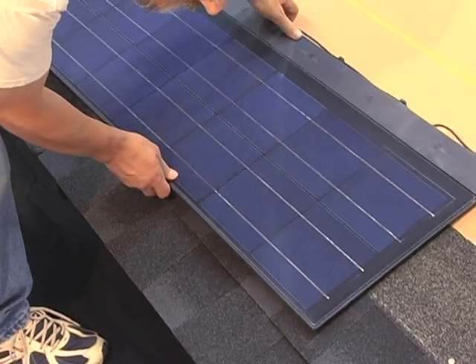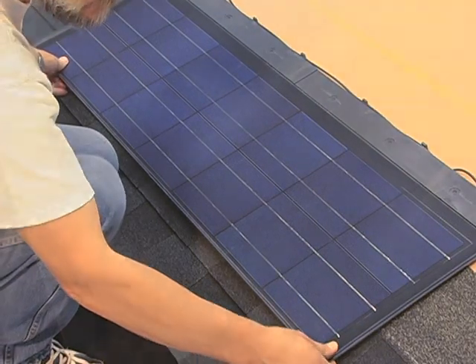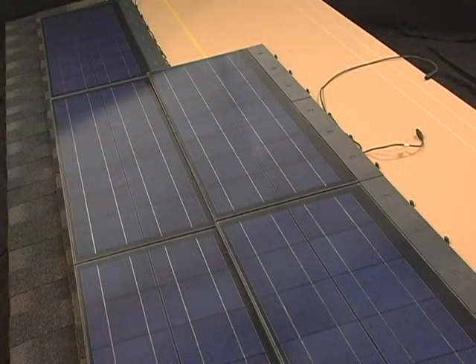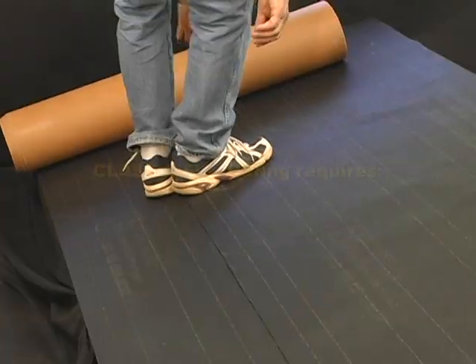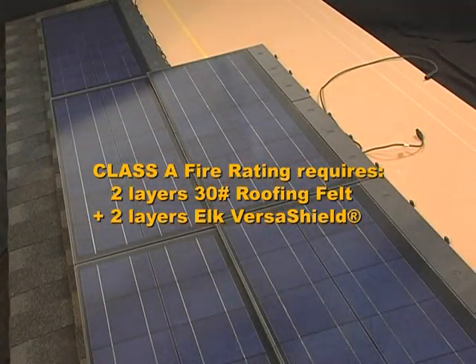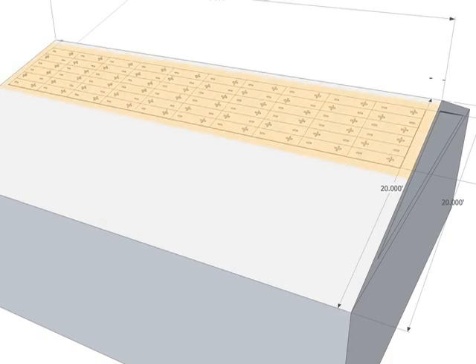Now let's focus on the rooftop installation that will be done by a qualified licensed contractor. The underlayment for the solar electric system is important and will vary depending on the type of installation. Sun Energy Shingles have a class A fire rating when installed in accordance with the installation manual in new construction or in retrofit application. In each of these applications, you will need two layers of 30-pound felt and two layers of Elk VersaShield to maintain the class A fire rating. This underlayment is only necessary on the section of the roof where the solar shingles will be installed.